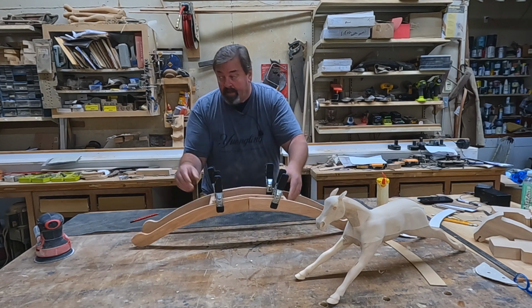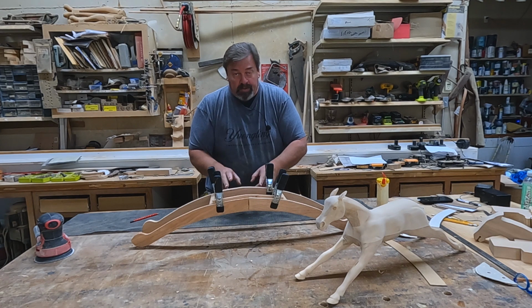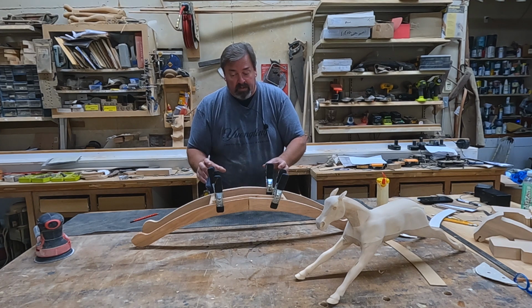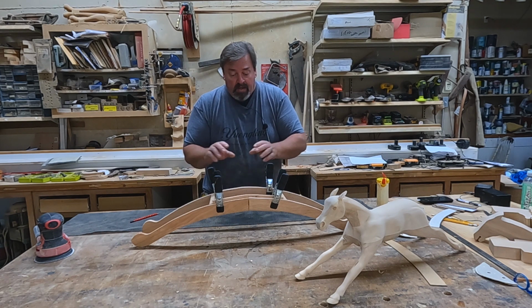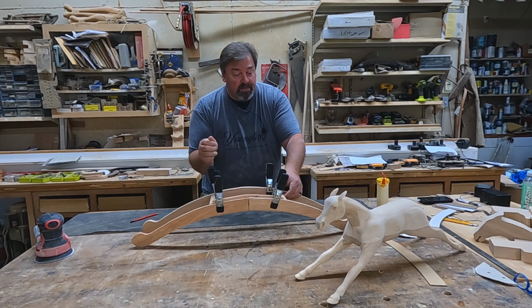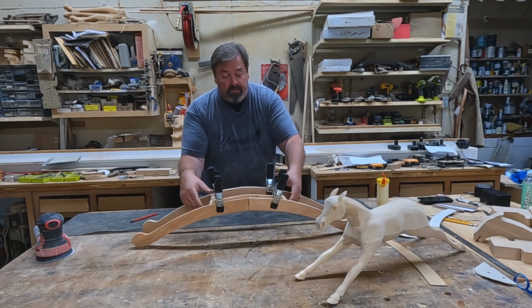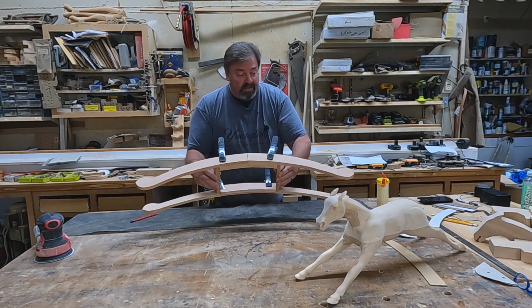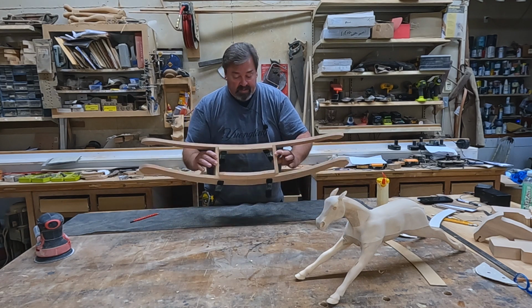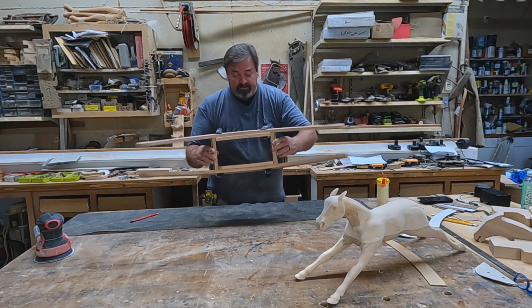So now we'll grab a couple of wood clamps. We can do one side at a time. We'll put a little bit of glue down and we'll clamp them nice and tight. We'll come in tomorrow, once the glue sets, take the clamps off, and take the stretchers off. We'll tap those out and pull those nails, and then we can run everything through the bandsaw again, and then we'll give everything a final sand. But these are going together beautifully. Nice. Good.